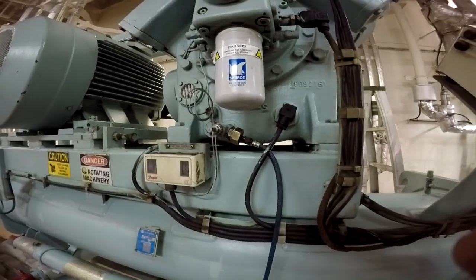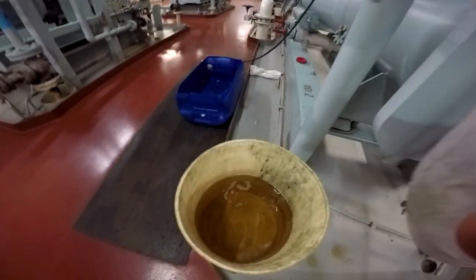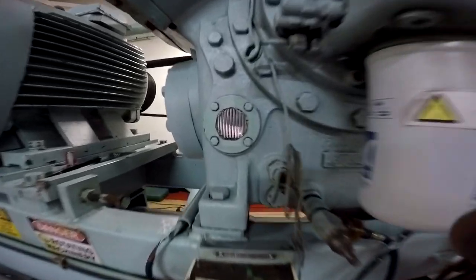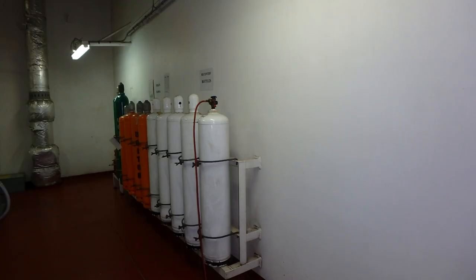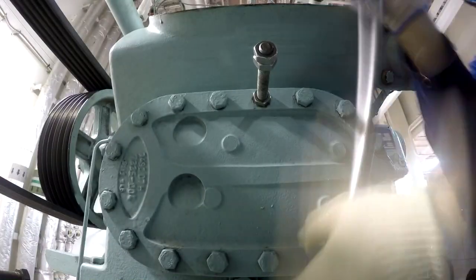...be evaporated from the oil. Okay. And now, as you can see, everything is already out. We suction twice or three times on the ground, and now we have drained the oil from the sump of the compressor, this way from here. All the oil will be drained, and always be careful not to touch this kind of oils, and always be careful not to have any leakage of the freon to the atmosphere, because we are thinking of the environment and we always protect the environment.